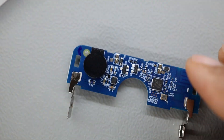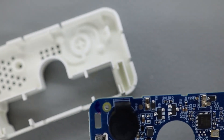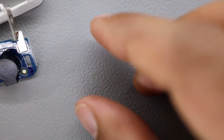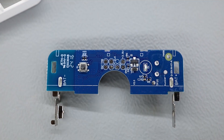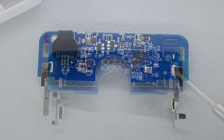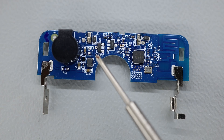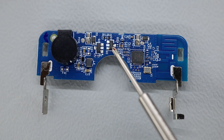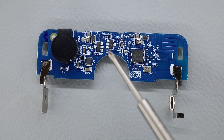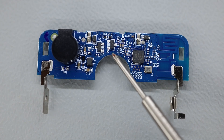The PCB is lifted — let's flip it. On the plastic you can see the place for the button, the buzzer grill, and the programming area. Flipping the PCB, we see the pairing button, programming pads with TX/RX, and the components marked Q2 and Q3, most likely switching elements. Googling the marking '1AM' reveals it's an MMBT3904, a very generic general-purpose NPN transistor. There's also a MOSFET. I'm not sure exactly what the MMBT3904 is used for here.